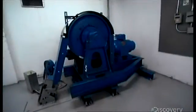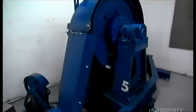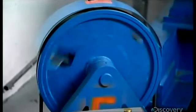Technically, one of these steel ropes is enough to hold up both the car and the counterweight. The rest are there for backup, in case one snaps. But what if the whole set is cut? Don't worry, it still won't plummet. This machine has a built-in failsafe. There's a governor located beside the motor, with its own pulley and separate cable attached to the car.